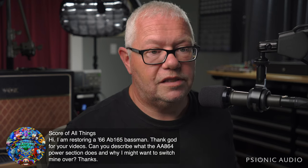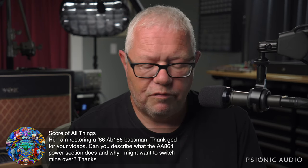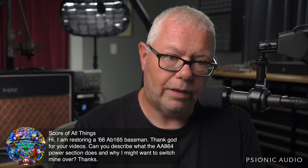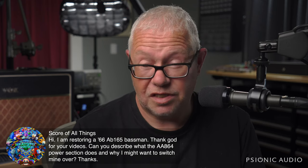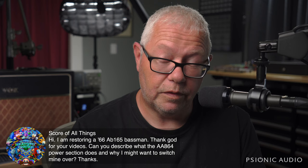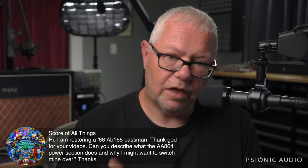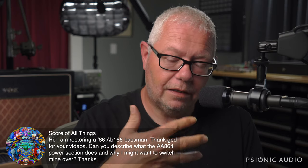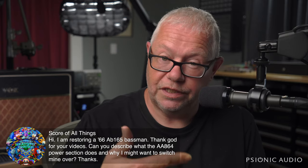Hey, Score, of all things, thank you very much. He's restoring an AB165, and he saw my videos where I said I like the AB165 preamp with one tweak, going into the AA864 power section. The AA864 power section is pretty much the same power section you find in every other Fender 6L6 amp in the 60s, the AB763s. It has the same negative feedback, and it reacts very predictably and has a very low noise floor and has a very nice musical transition from clean to breakup.